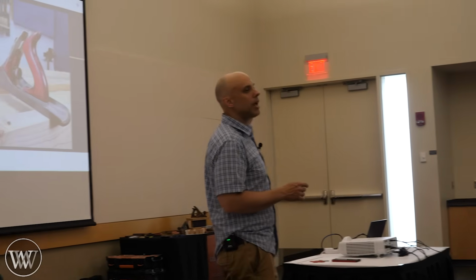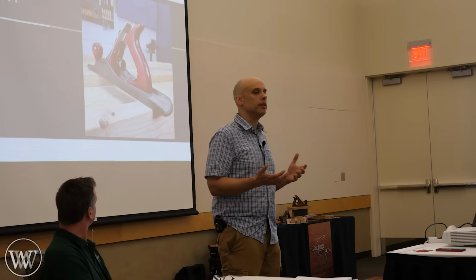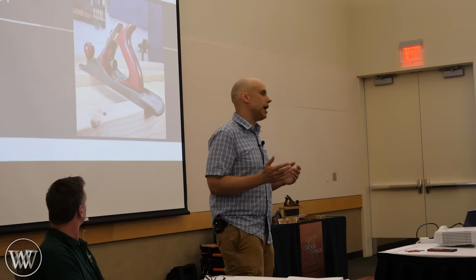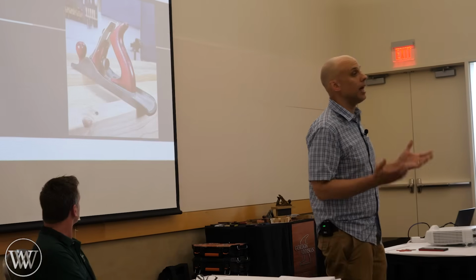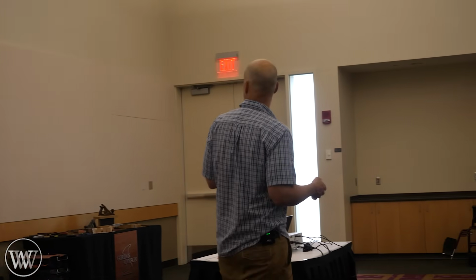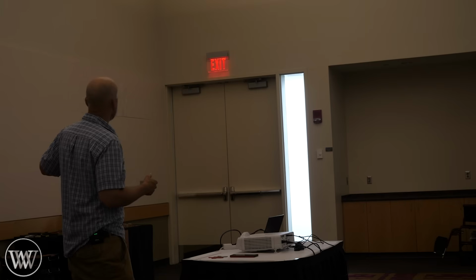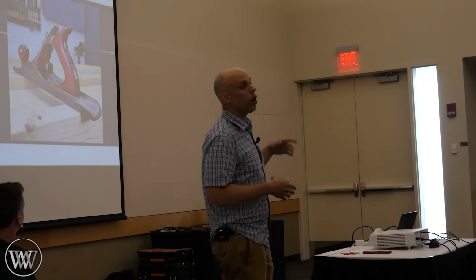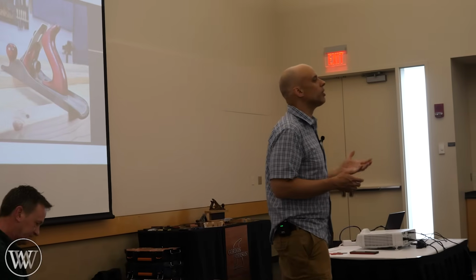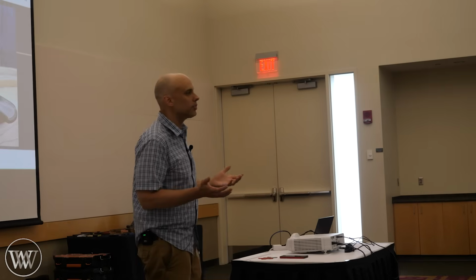This is a Victor hand plane. Victor was kind of a homeowner or carpenter line that Stanley produced, and they're really an underappreciated plane. They typically go for a lot less than a standard Bailey plane, but they're 90% the same. I've used this one for years, and I really like it. And they set out the Victor line with a lot of red. They painted the frog red, the red logo, and then the knob and the tote are beech that were finished with this really pretty horrific red lacquer that flakes and chips off and looks like garbage.